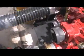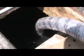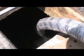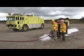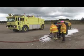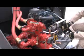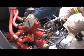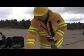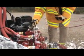If you're not using the water tank, obviously we will draft and need to bring water into the pump. So at that moment, you will need to prime the engine. If you're not using the pump with a service line, but your pump is primed and ready to use, you need to recirculate your water by opening the tank fill, so you won't generate some heat inside the pump and, by generating heat, damage the pump.